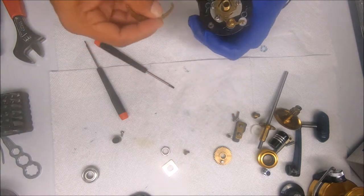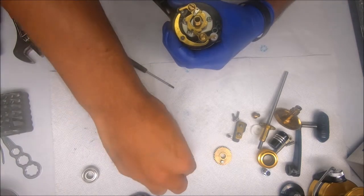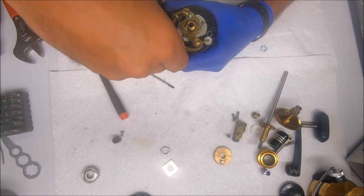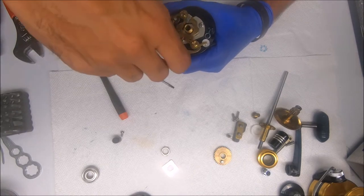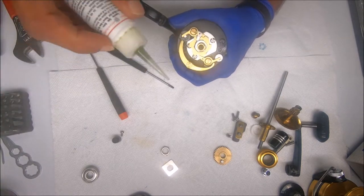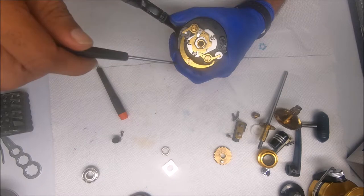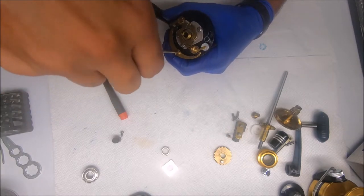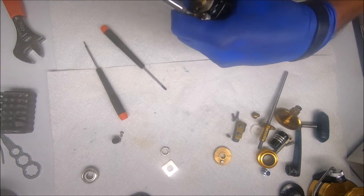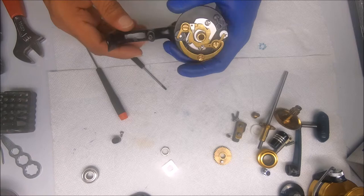Same process as the other one essentially — find the groove for the collar. Having this one in place helps aid in that process. Then locking it down. For the transfer lever, I rest it on top of the eccentric for the silent dog and then screw it into place as well. For the transfer lever I do add a little bit of oil there so it can kind of work its way around. Lock all these down. And that's pretty much that for the upper portion.